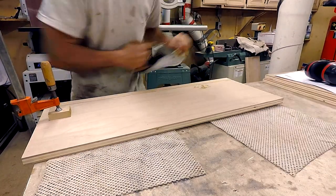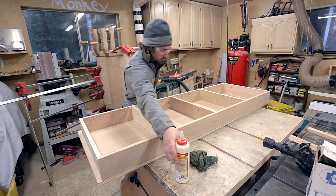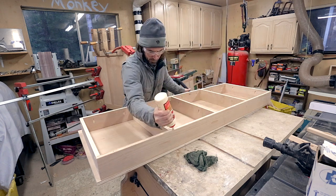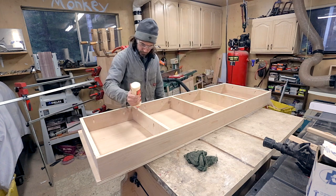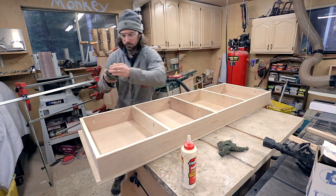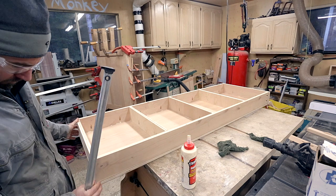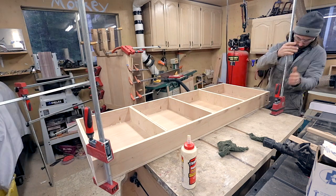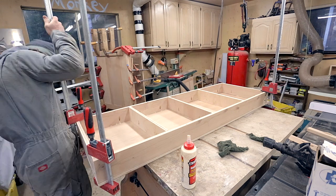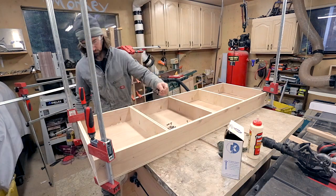After it is glued up and dried I have to plane down the bottom. This is because three-quarter-inch plywood isn't quite three-quarter inch — it's a bit thinner. I can then apply some glue to the kick base and screw in the pocket holes to attach the cabinet bottom. I do this upside down and it is easy to accidentally attach things in the wrong location, so I usually add marks on the side to line things up. The location of the kick base isn't 100% critical but I want the back and sides to be flush, so I clamp it down to make it more stable as I drive in the pocket hole screws.